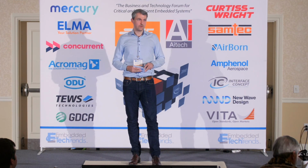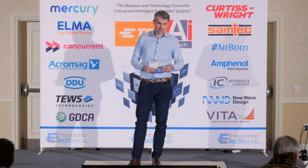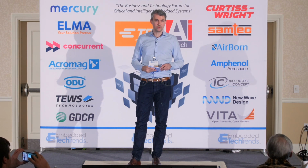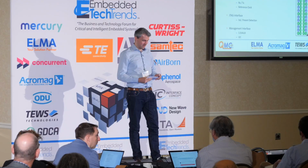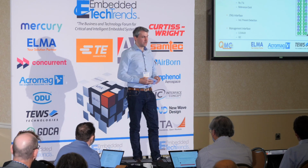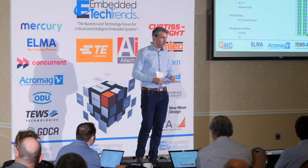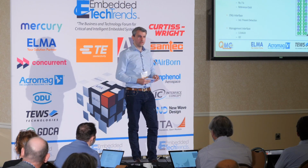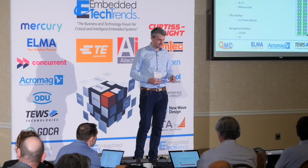And then, as a third point, you may need to supervise your QMC via IPMI. And that is definitely possible with QMC, but we've dedicated a whole slide to that, so more about that later. And then, as a last thing for this slide, we have the JTAG interface, that allows thorough testing and factory programming of the QMC without wasting valuable PCB space on, for example, debug headers or an onboard test.